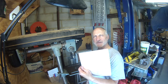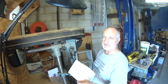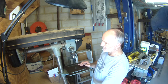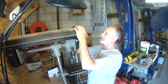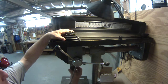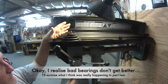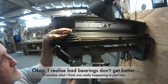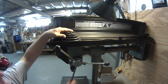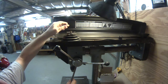This is my 1996 Delta Radial Drill Press, 32 inch. I've had to replace the chuck once on this, but what happened was some time ago, the bearings down here in the spindle had gone bad, and they're still bad. I've never replaced them. They just seemed to start working later, but while they were still bad, it was vibrating quite badly. I tried to pull off this top pulley and I ended up just breaking it.